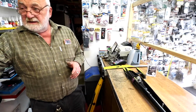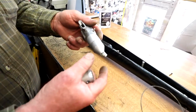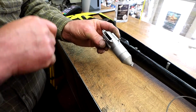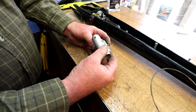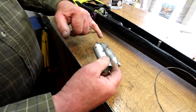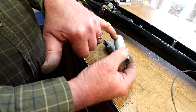Okay. Now, this is a standard exhaust. And we use this on the 25. Now you can see it's got a great big hole. What we do is we actually jam that piece of tube up there. So that now has a 1.6mm hole. That is for the pressure. It goes back to the tank. All that goes through a 1.6mm hole.